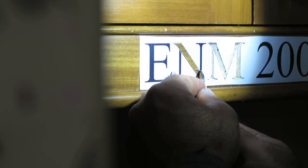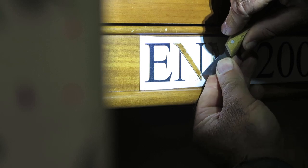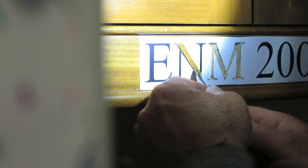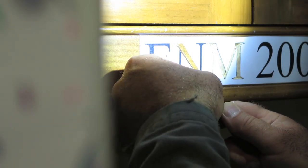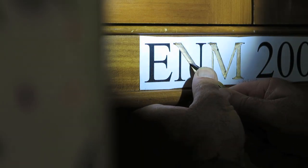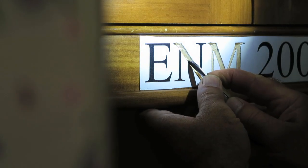Here I have part of the paper section of the letter N removed, and I'm working down at this angle. It's not absolutely essential that the knife be angled correctly for removing the paper, but it is very important now, and you want to keep that angle as consistent as possible. I'm getting to the bottom of the V-shaped groove that I'm carving, and the chip is ready to pull out, ideally in one piece. When that comes out, I'll be able to see how cleanly and consistently I made the repeated slices necessary to remove the wood. It's not unusual to have to remove more wood down from the point of the groove, but it's an easier job now because you can see what you're doing — you're not guessing about the angle of your knife or whether you've cut deeply enough.